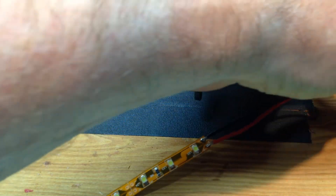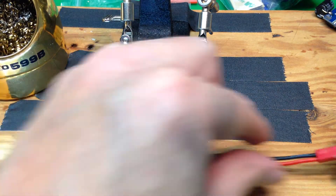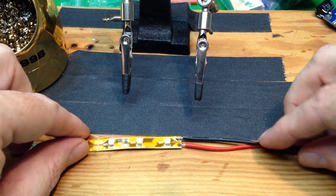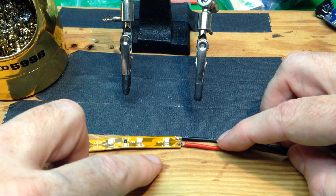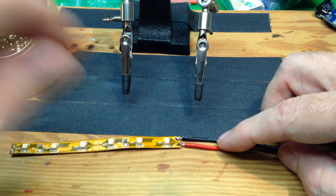We have a battery — let's see if we've done this right. Bingo, that has done it! So that's how you solder a wire onto a flat surface: tin the wire, tin the surface, and then just melt the solder together.